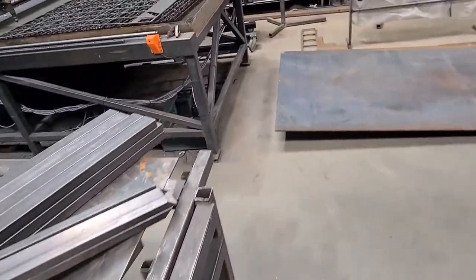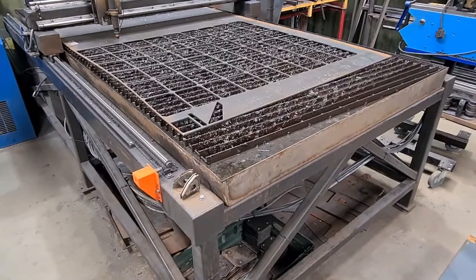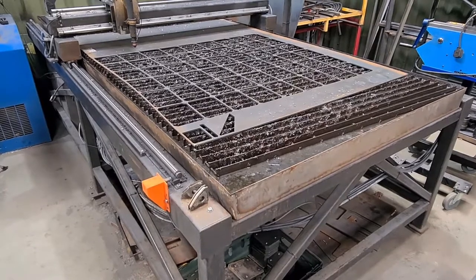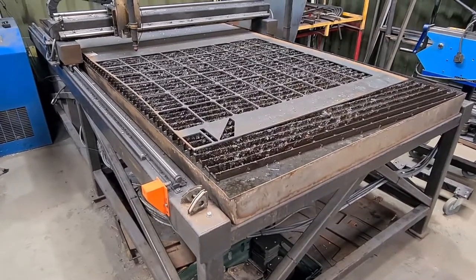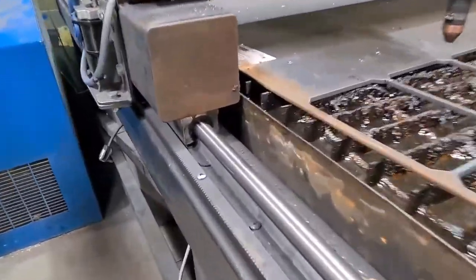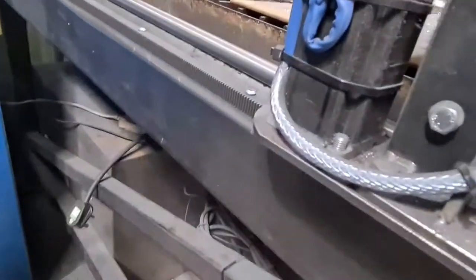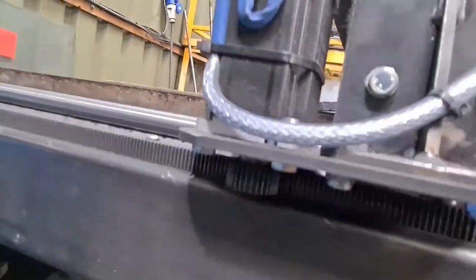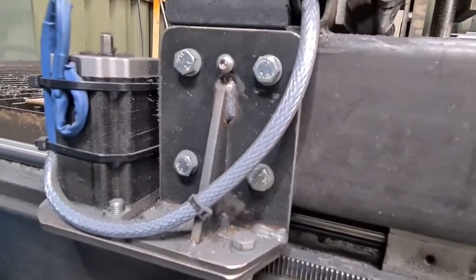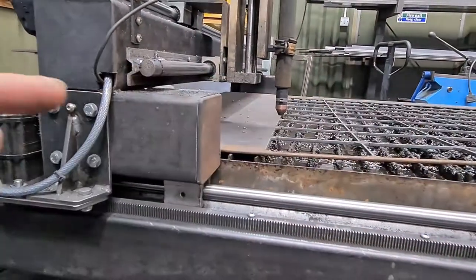What I've been finding with my plasma cutter is that we were getting some wobbles in the cut — so on change of direction. I tried everything trying to figure out what exactly was going wrong. We tried slowing up on corners, we tried doing all kinds of stuff, still getting this strange wobble. I checked the bearings — they are nice and tight, running smooth, no play at all. I checked the pinions, checked the motor mounts, checked all the stiffness of all this.